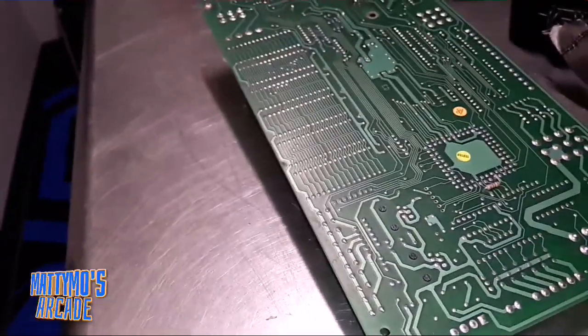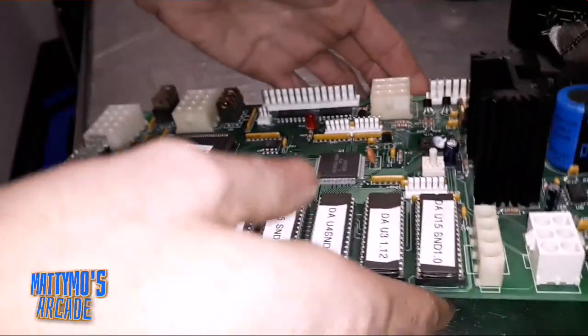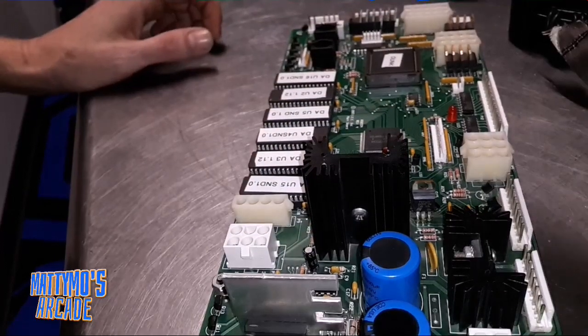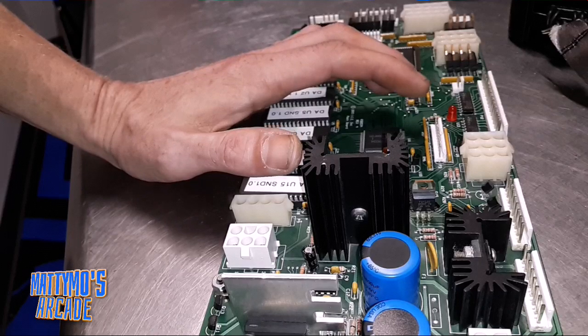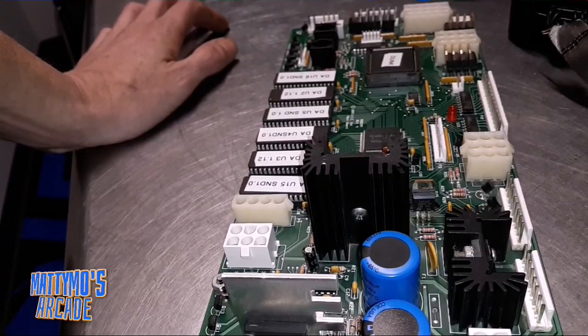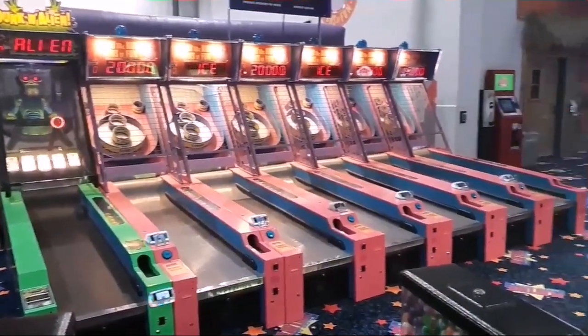Let me see if I can get this to stand up and not be so shaky. So regardless, if that's the problem, I am going to check that. I got my meter out. It is Q15 — the transistor is a TIP122. I did have a TIP120 also, and I read online that it is compatible. I'm not sure, but first I'm going to check and make sure we have continuity on those traces, and then we'll see how it goes. We'll be right back.